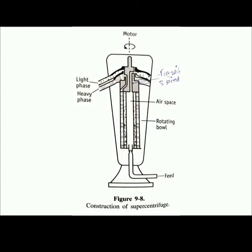The next point is super centrifuge, which is the last topic of this chapter on centrifugation. A super centrifuge is a sedimentation centrifuge — a non-perforated basket centrifuge. The separation is based on the differences in densities between two immiscible liquids. During centrifugation, the heavier liquid is thrown against the wall while the lighter liquid remains as an inner layer. The two layers are simultaneously separated using modified weirs.